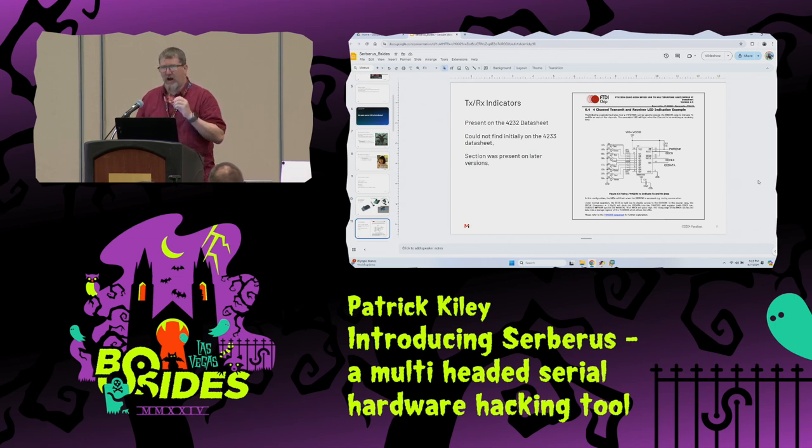So on an FTDI, you can program your own serial number, your own VID, PID, which is how the computer identifies itself and which drivers to use. That's all programmed on this little tiny EEPROM on the device. It's right down here below the main chip. But it only uses it during the initial startup of the device. So they repurpose the EEPROM connectors up to the shift register and use it to drive the LED indicators. I included that feature on this.